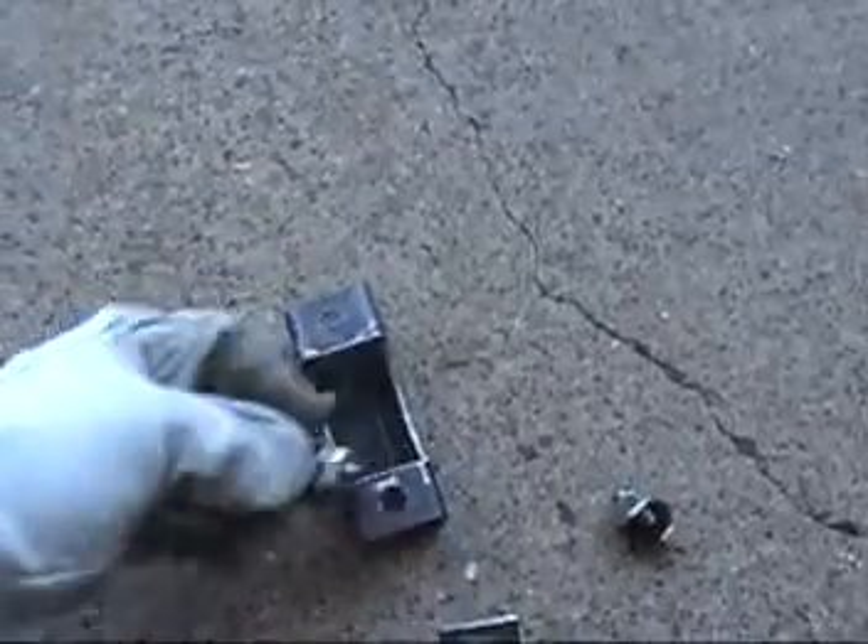This is the little saddle bracket part that's going to go in here. It's going to get welded in, and these nuts are actually going to be welded on too, on the back side of this hole. So as soon as I get the nuts welded on, I can weld this little saddle in place and then keep going.